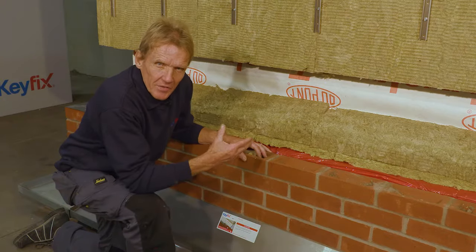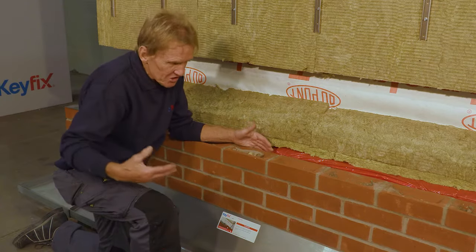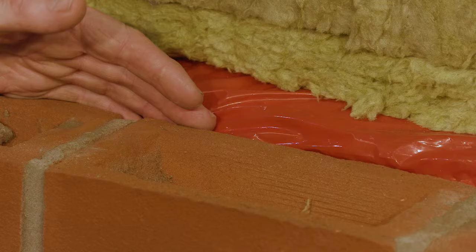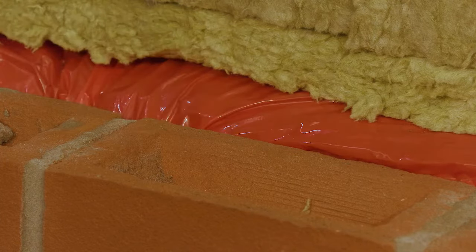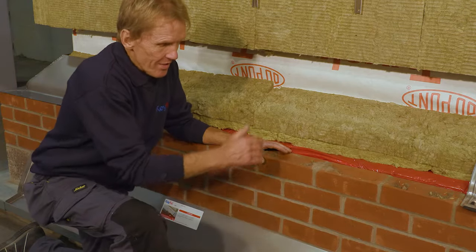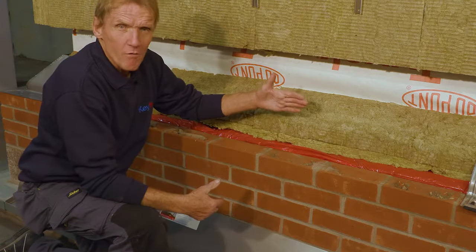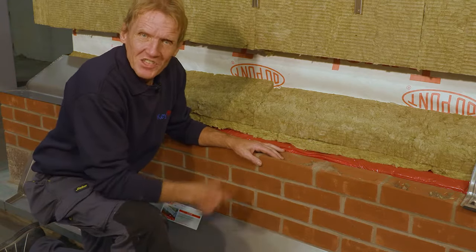Now, every bricklayer knows that the function of a cavity tray is to deflect any moisture that's penetrated the outer skin through windblown rain and is running down the inner side of the outer skin. And it deflects that moisture to the outside through a series of weep vents. Now, cavity trays are typically used in areas where that moisture might transfer from the outer to the inner skin. And typically that could be something like over a fire stop, a masonry support system, or even a ventilation duct.